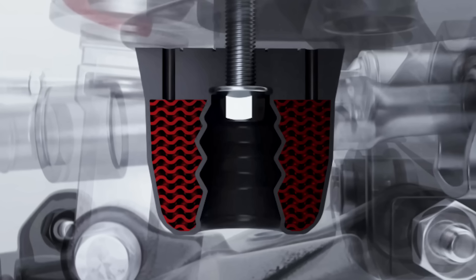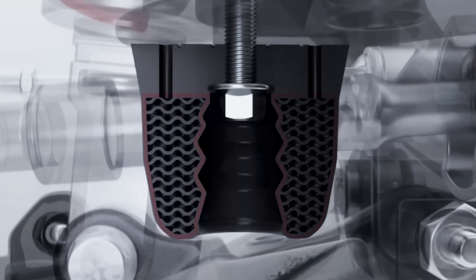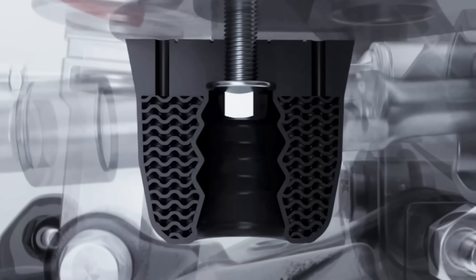This is actually really incredibly brilliant because if you look at the Perry Parts bump stops, they couldn't actually be molded — they have internal geometry that cannot possibly be molded because you can't reach inside of a part with a mold. They also have external geometry, the ripples on the outside of the bump stops, that is also extremely difficult to mold if not outright impossible. These features make the bump stops so much better and leverage the process they're made with so that you can get characteristics that would not exist any other way. You have full control of the engineering.